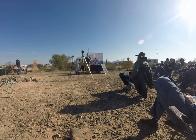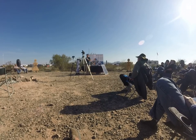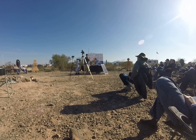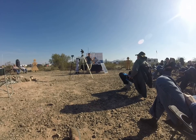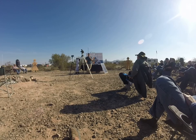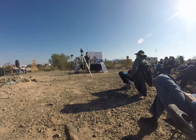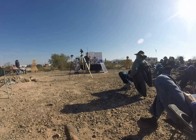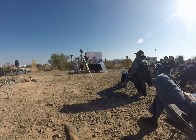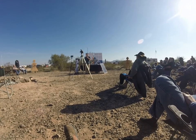One more thing about lithium batteries is capacity. Just like with a lead-acid battery, you really don't want to discharge it below 60%, about 12 volts, because it's hard on the battery. That means if you have a 100 amp-hour battery, you really have about 60 amp-hours effective to use. With lithium batteries, you can use about 80 to 90% of its capacity — so if you have two 100 amp-hour batteries, the lead-acid gives you 60 to work with, and the lithium gives you 80 or 90.